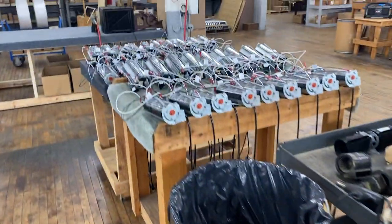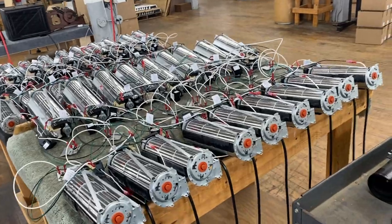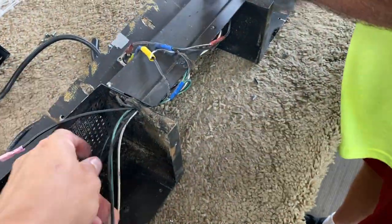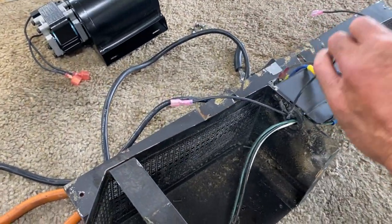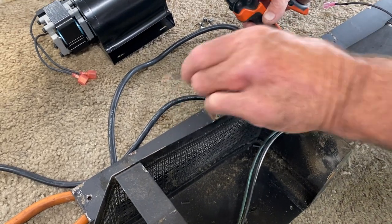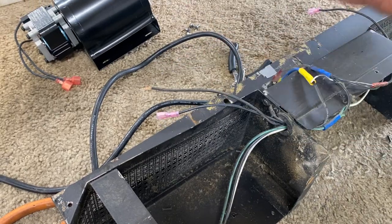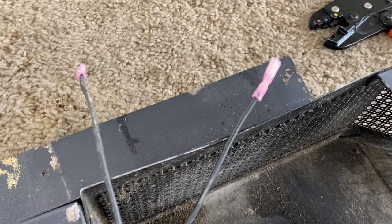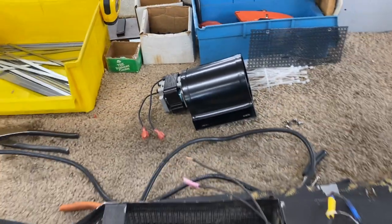We've got some GFK4 kits for a few later fireplaces getting made here in the shop. We're just taking those two leads that we took off and putting a couple of new female terminals on them. We're using female terminals on the leads here because the blowers will have male terminal flying leads coming off the motors.